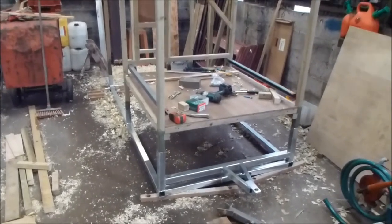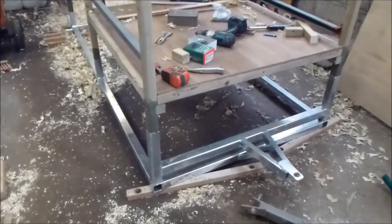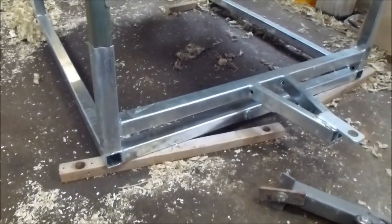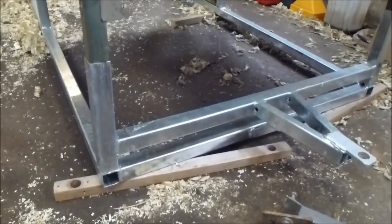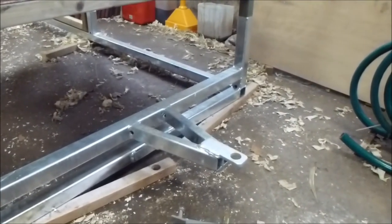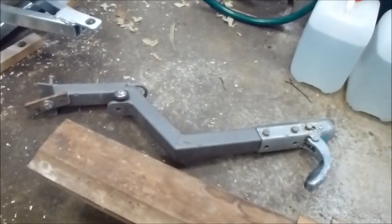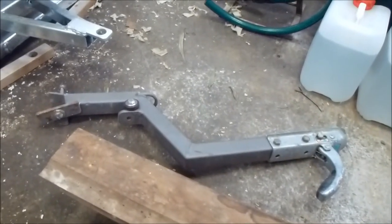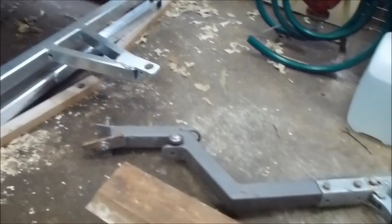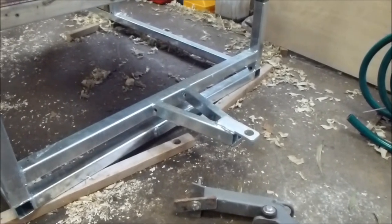I've based the whole thing on a frame or chassis, which is down here, made from 50mm square box section which I've welded and had galvanized. The hitch here is at quite a low level, and I'm going to take advantage of this hitch adapter which I'd already made — I use it for a dinghy launch trolley — converting it to a 50mm ball. I'll connect that on there, lifted up with a small tractor probably.